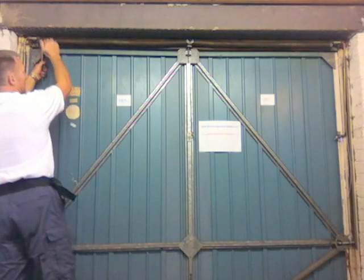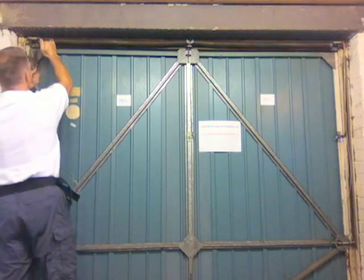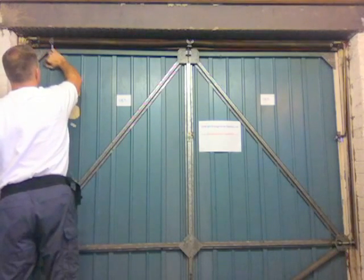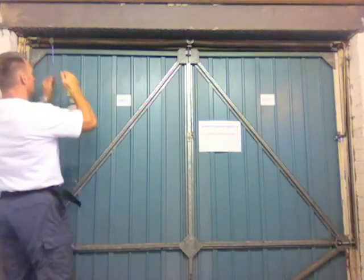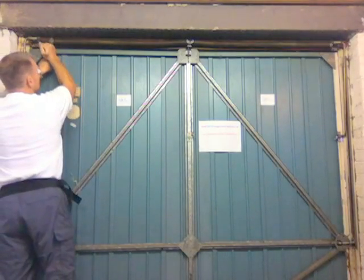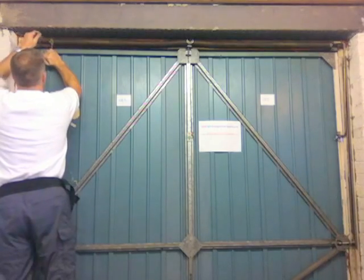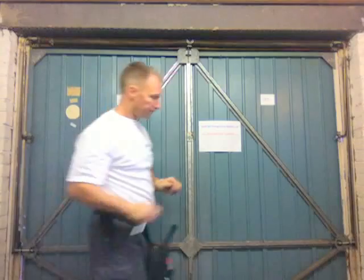put one of your tension bars into the hole into the collar and release the mole grips, and you will feel the tension come onto the tension bar. Taking the other tension bar, put it into the next hole and let the tension wind back onto the cables very slowly.